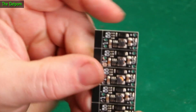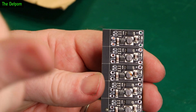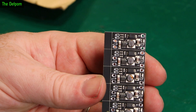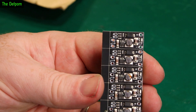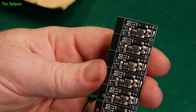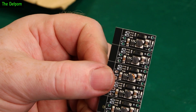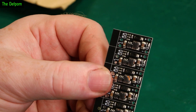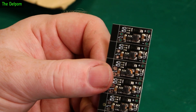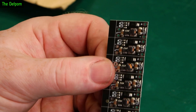And these were to allow for battery voltages. To run off a single cell battery — I'm using an 18650 battery — so that voltage could go down to around three volts, and it's not quite enough. So I put on a 5V boost converter, and that's what these are, I think — 5V ones. So that can then boost the battery voltage up to 5 volts, that's then dropped back down again by the ESP32's own voltage regulator. Not perfectly efficient, but at least then it's getting all the voltages it expects to get. It doesn't matter what the battery voltage is, it will just work regardless.